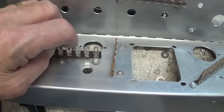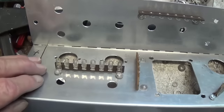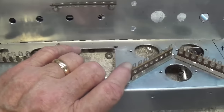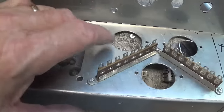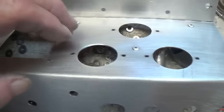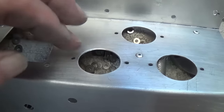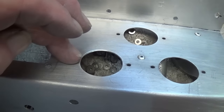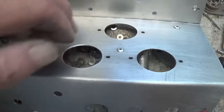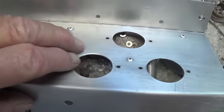All the necessary terminal strips have been riveted in appropriate places to allow the circuit to be fully supported as it connects the different components. Since I'm going to rivet in the three large octal tube sockets, I'm going to go ahead and rivet them in before I paint the chassis, because riveting afterwards the rivets will be real bright, shiny silver - they'll stick out, they won't look right, and I might also damage the paint as I'm using the rivet pliers to pull the pop rivets through.